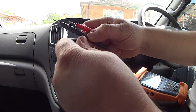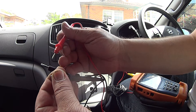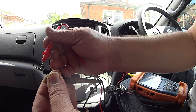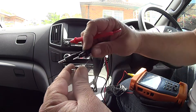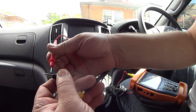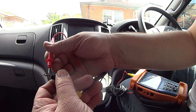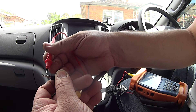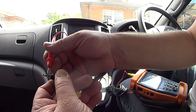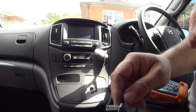This is a 4-pole 3.5mm plug - you've got one, two, three and four. I'm finding the outer one on the second pin. Now testing for the inner one - I'm finding the inner one on the third. So if you're holding it from the plug: this is the tip, this is one, two, three and four. The inner one is on the second last, or the one next to the tip. The tip and the base are not used - it's the two in the middle. So that's the pinout on this particular cable. Now you can make your own.